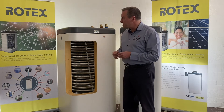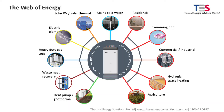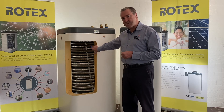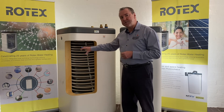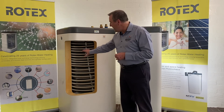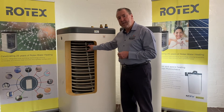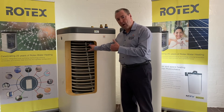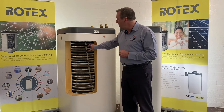On the left-hand side: solar PV or solar thermal, electricity, gas systems, heat recovery through heat exchange sources, waste heat, and geothermal heat pumps can all produce the heat energy that we require into our unpressurised vessel. Those energy sources are interconnected, working unpressurised as well. We then can create the situation where that energy is transferred into our main supply of water, which is either connected to domestic water heating fixtures or hydronic or pool and spa heating requirements.